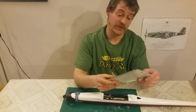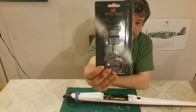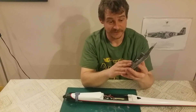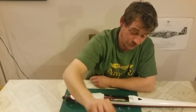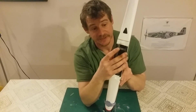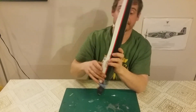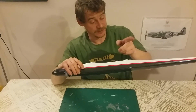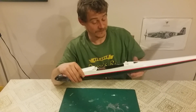We've had to get a proper carbon fibre receiver — a Spektrum AR6270T — a telemetry receiver, not that I'll be using telemetry. I just needed it because it's a carbon fibre receiver. The plan is to mount the receiver inside, and we've got two long aerials which need to be run outside the model. The way we're going to do that is drill the fuselage and insert some small plastic tubes to accommodate the aerials, letting them come out so you've got much better reception and the carbon fibre isn't blocking the signal.